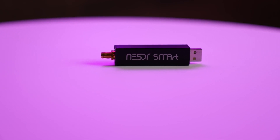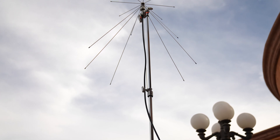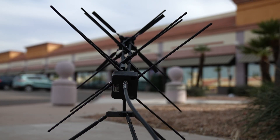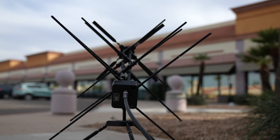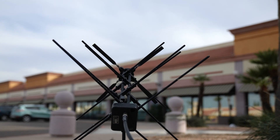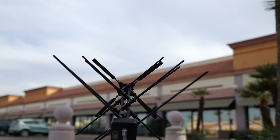So a USB-C to USB-A OTG cable, which allows us to connect our radio interface. The radio interface we will be using is the RTL-SDR. With that, we're going to need some type of antenna. We can use a discone antenna, which is the cheapest option — you can get them for about $50. They do go up in price, but it's not the most reliable. If you want to spend a little more, you can get a smaller UHF military SATCOM antenna, found in the range of $100 to $300. The one I have, I picked up for a screaming deal at around $200.